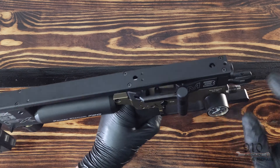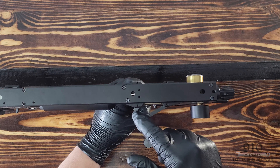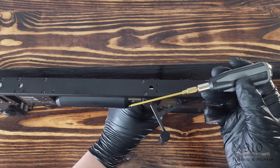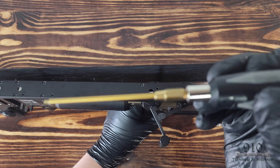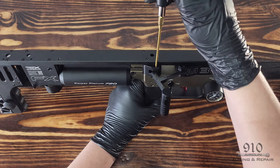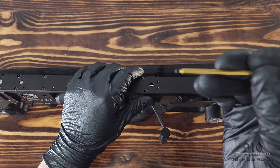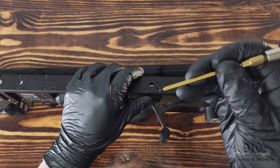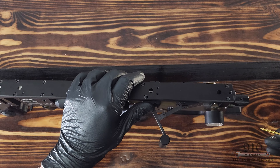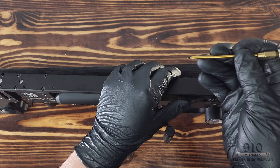The first step of this process: there are two screws that cover up the pins that hold the lever and the linkage in place. Two screws right there — very small. We're taking our 1.5mm Allen and just going to extract these. They are very small — can't even get the focus, they're so small. Don't let them roll away. And there you go, there's the other one.